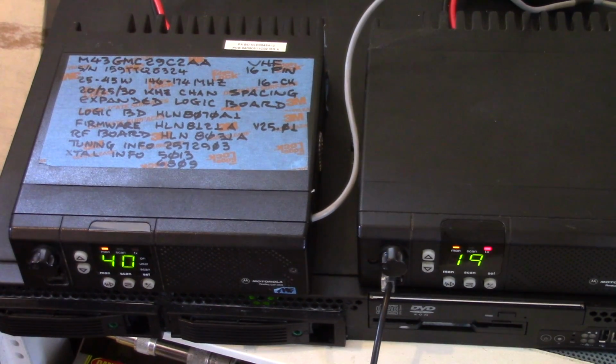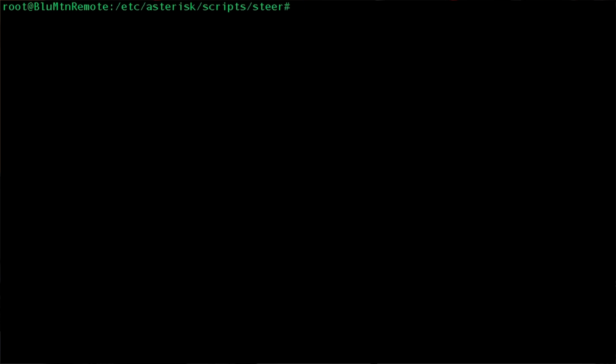If I go over to the code and I run my channel steer script on UHF, I can switch the UHF channel, or on VHF, running the 40-channel steer script. For UHF, I'll run the 20-channel steering script I wrote, and so you type that by using ./steer20.sh, the channel you want to go to. So let's say I want to go to 5. And then the pins I'm using. So I'm using 12, 13, and 14.